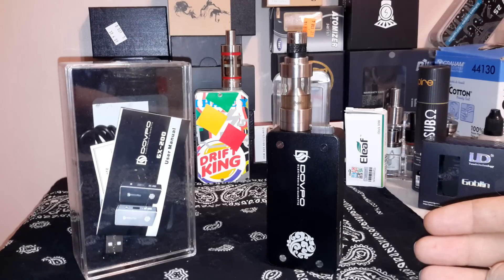It's rated for 20 amps but it's got a 30 amp breaker in it. It will also monitor temperatures inside — basically monitoring the battery temperature since that's what's touching the sensors. If the batteries hit over 70 degrees it will shut off to protect them. That's a great feature if you're pulling too low or have a short somewhere.